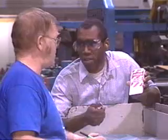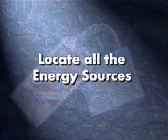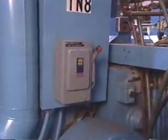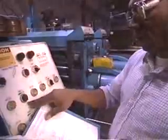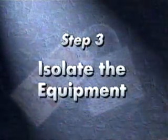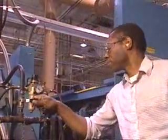You should also explain why the shutdown is happening. Now, move on to Step 2: Control the energy source. Locate all the energy sources. Remember, many machines have multiple sources or have backup systems that come on automatically. Make sure you locate all of them before you proceed. Then shut down the equipment by following company procedures and/or manufacturer's instructions. An orderly shutdown will keep you and other employees safe when the equipment is de-energized. Once the machinery is shut down, isolate the equipment by locating and operating all of the energy-isolating devices. This might mean shutting off a circuit breaker, closing valves, disconnecting process lines, and line plugs.